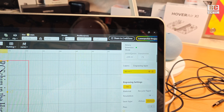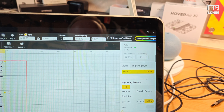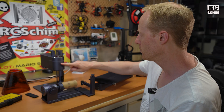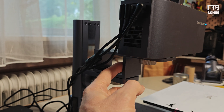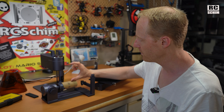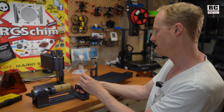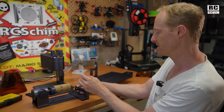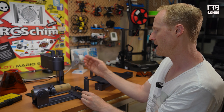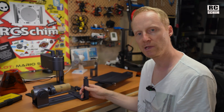The rotary tool only worked via Bluetooth connection on PC, not with the USB cable — bear that in mind. In the PC software you need to find the spot to enter the diameter of your rotary object by scrolling down. You can find the circumference, or just measure the diameter in millimeters. If you place the rotary over the laser head you need to mount the height extension, as the laser needs to be 15 centimeters over the focal point.